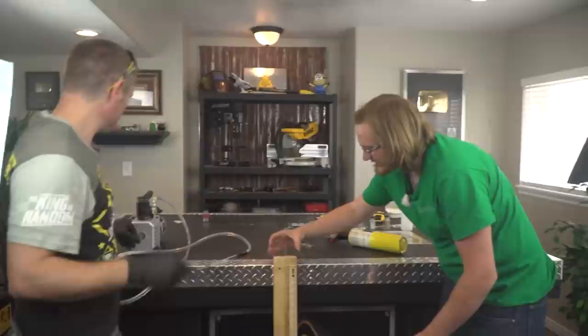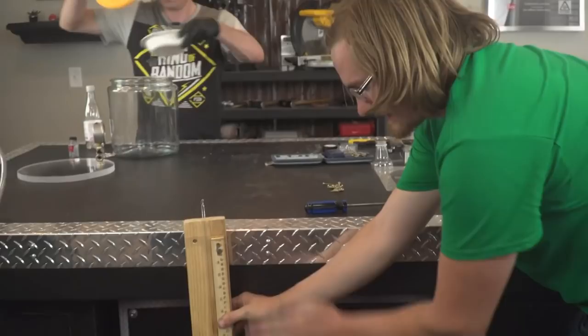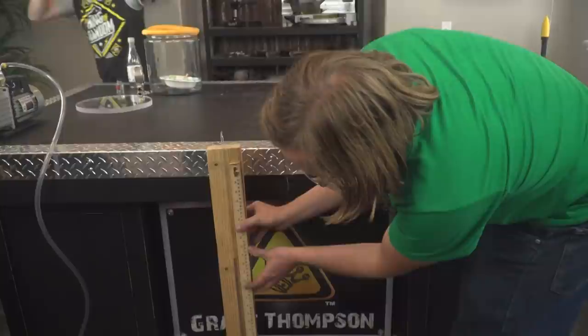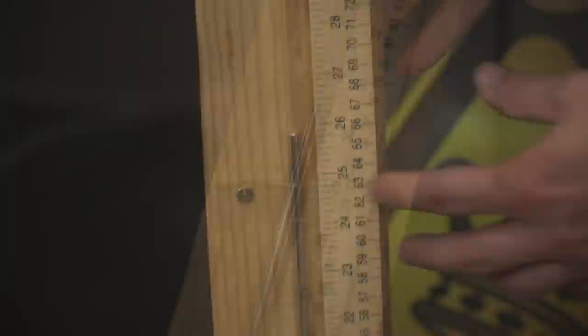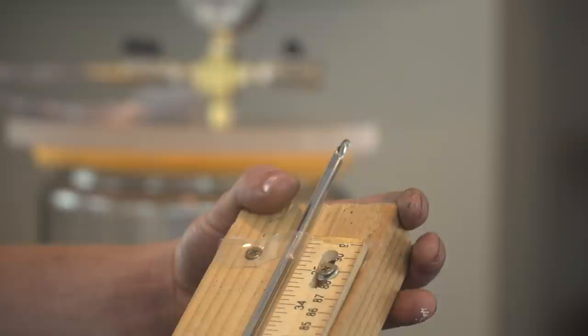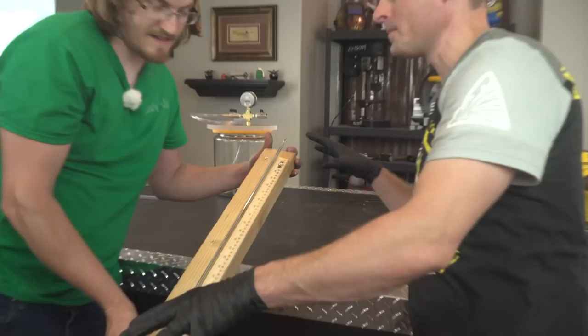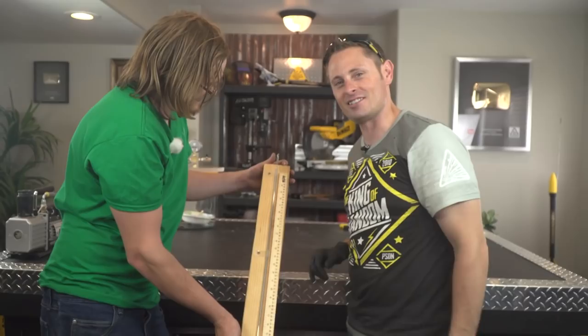So we might put something on the top here to protect this little nib, just for a little safety. That's the completed thing — in a nutshell. I'm going to adjust the scale. There it is — the completed barometer. See how it's kind of tipped on its edge here? There's a slight angle. If I bring it back up to vertical, the height of the mercury actually drops. We removed practically all the air — there's a tiny bubble in there. By removing the air, it actually sucked the mercury right up to the top. The chamber's completely full. I like it.